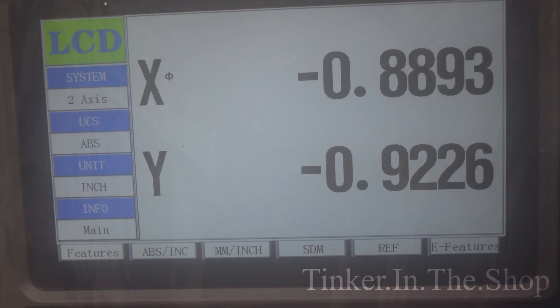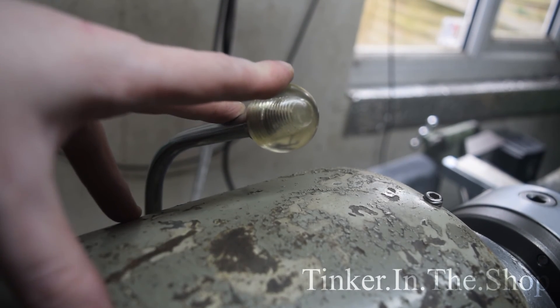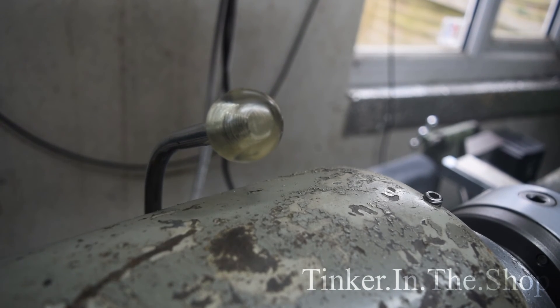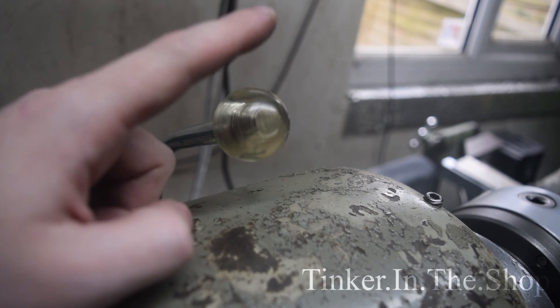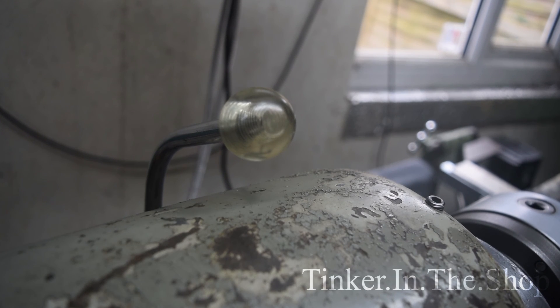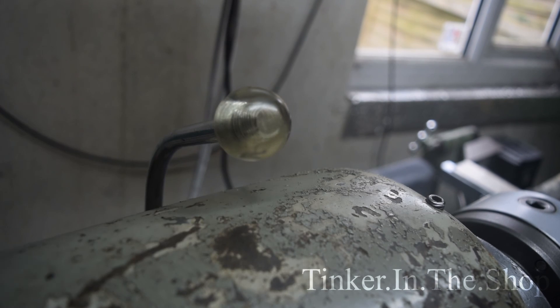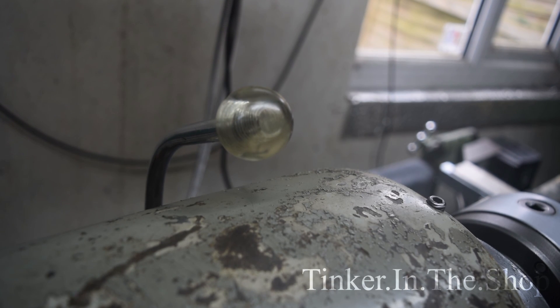Everything's in place. I just need to reroute some wiring I did getting the main motor on/off lever to work. The last thing I need to do before I can put the lathe back against the wall is I wired up the motor start and reverse switch to the VFD — that's the low voltage control circuit. It took a little bit of fiddling around to get it to work. The annoying part is the VFD and knowing which settings to change, and it doesn't always seem to work the first time even though you go around in circles. But it's working now, and that's something I've been meaning to do for a long time. It made sense to do it while I had the lathe out so I could get to the contacts in the back. But that's about it — just a little bit of an extra update on the covers and how it's all going, and hopefully I can do some projects now.